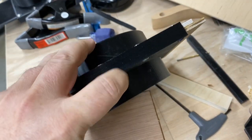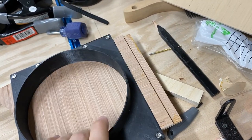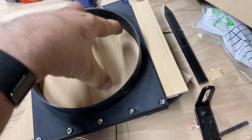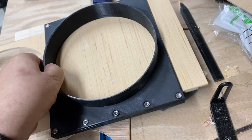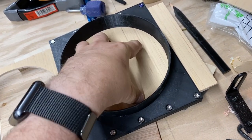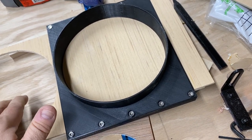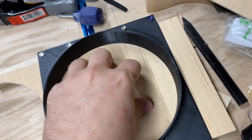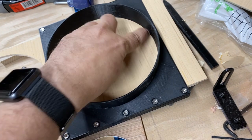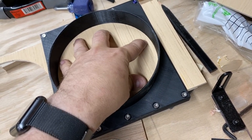I typically put the smoother side of the plywood so that it's facing up. These do have a thicker and a thinner ring. So this one is intended for something to go on the outside of it, and the other side I usually print with one that is intended for something on the inside. It doesn't really matter how you cut the hole — you can use the inside or the outside one. I usually use the outside because I figure it's the largest amount of surface area. I've never had one of these jam due to debris or anything, but they sometimes do collect debris on the surface, so don't be surprised if as you're opening it, it's a little crunchy. But this fits pretty tightly with the size of wood that I'm using and the spacers that I've chosen, so this should be pretty good.